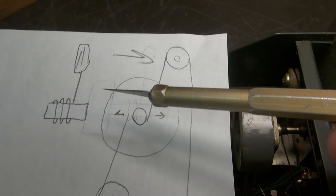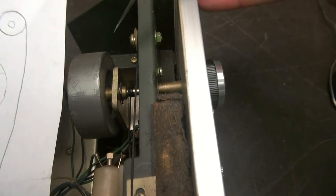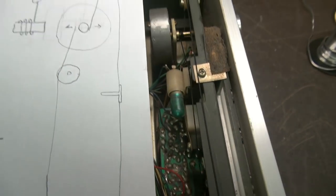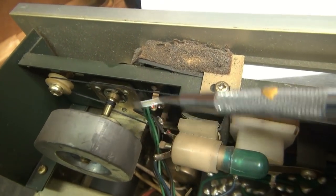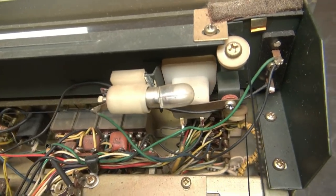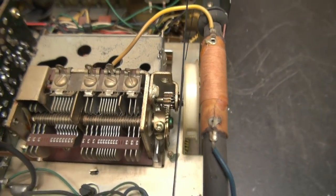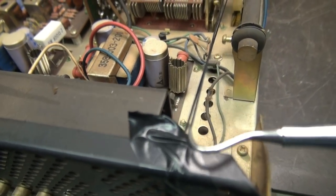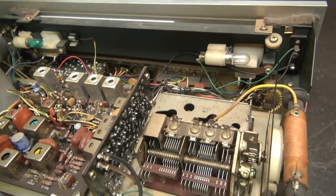Per my fine sketch here, you'll see the three turns going around the pulley — this is viewed from the front, that's the rear. I have that in, and I'm up and over the first little idler pulley with the cord pulled back. So now I'm going to string the rest of the unit. Here's a progress report: around the pulley, around the idler, she's routed all the way down and across — around this pulley and the bottom pulley — and we're ready now to hook up to the main tuning cap. If you need an extra hand at any time, use some electrical tape to keep tension on cables, because if one of these lets go it's going to fall off everything you've already accomplished.